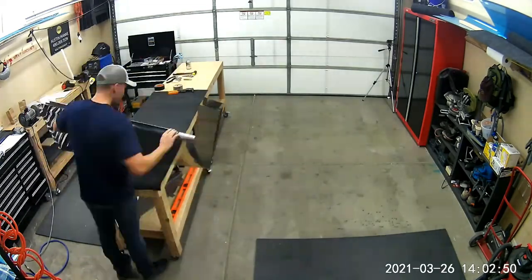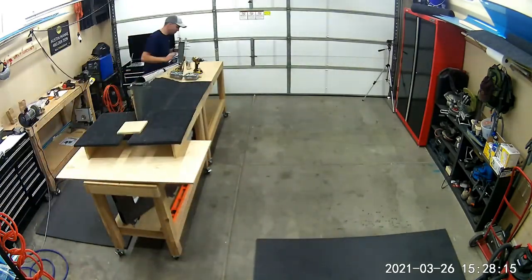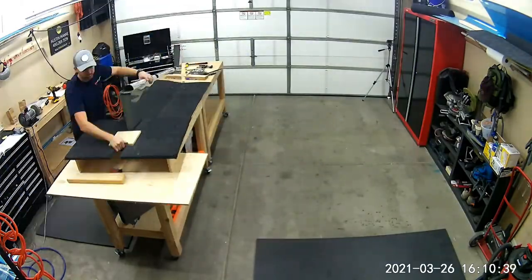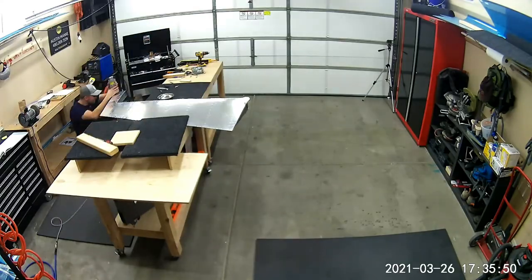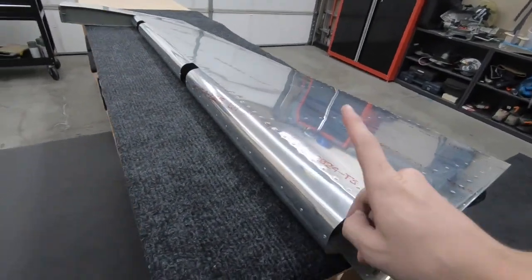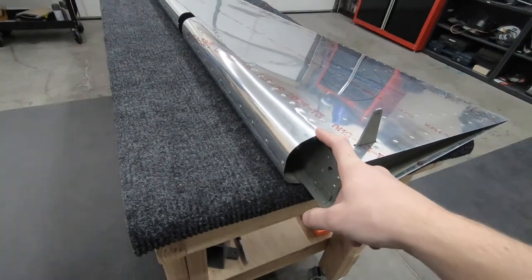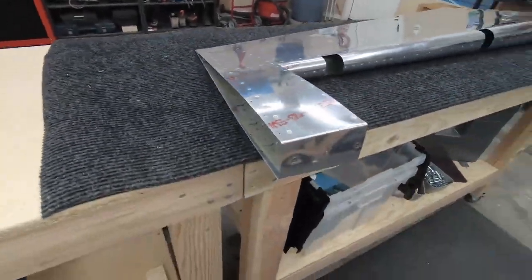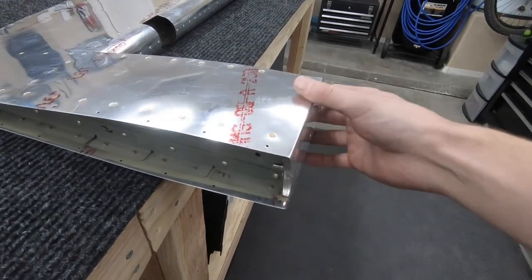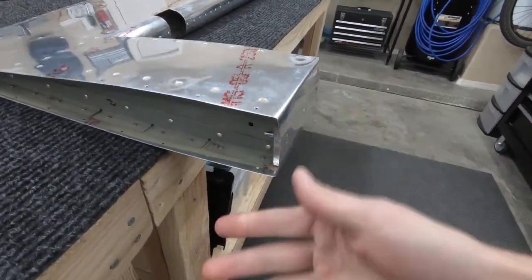I don't have any super close-up footage of bending this leading edge — I lost a lot of footage during the process, and the next clip doesn't have audio either. But this was pretty straightforward. I used a piece of PVC pipe on that skin, duct taped it to it, and slowly bent it using a pair of locking vice grips on one side and channel locks on the other, making sure not to let it slip and impact the skin — which didn't happen. Everything went perfectly smoothly. The very last portion involved putting 90-degree bends on the top portion where the counterbalance weight was, using a wood block and a soft-faced hammer. I also went ahead and threw a rivet right dead center between the two screws because I had a little pillowing in the skin.